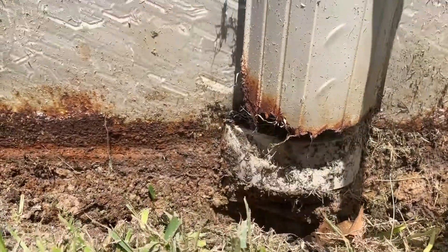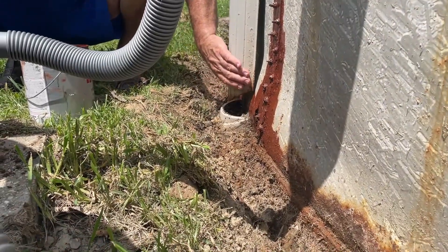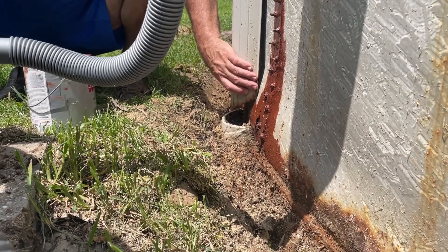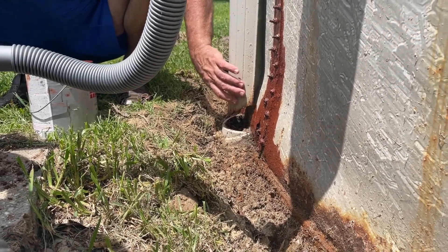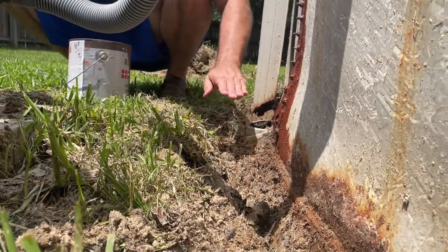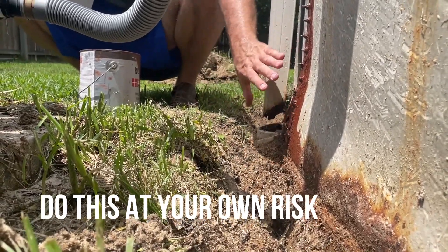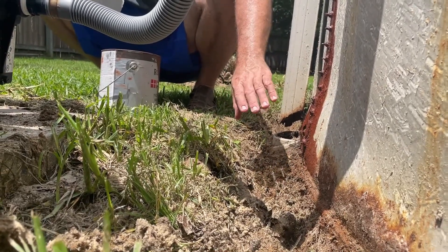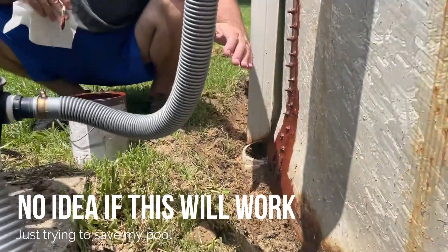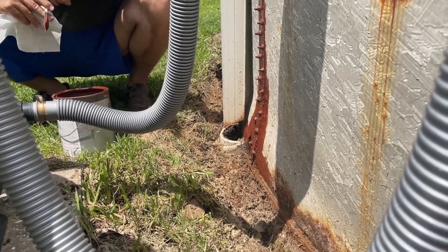We're going to get some quick-crete concrete and make a little slope here, going up as high as needed. This section is obviously rusted out. I was thinking about replacing this piece — that's probably going to be a good 50 to 60 bucks just for this one piece, and another one is out too. So instead of spending that money, I'm just going to go higher with the concrete — a little ledge right here that will support the area that has been damaged and weakened from the rust.